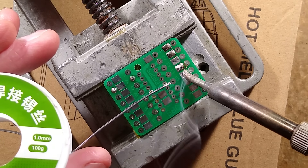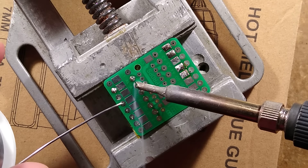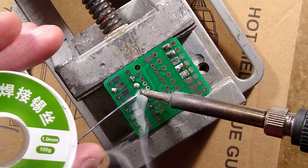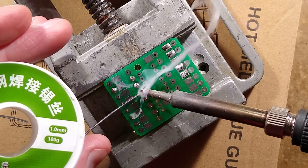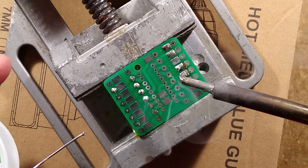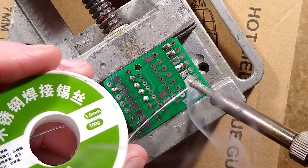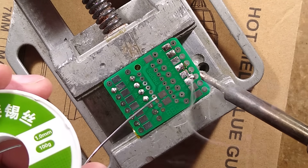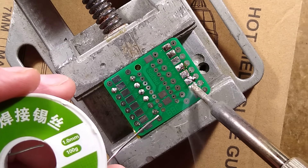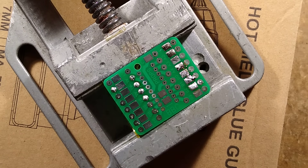Well, it's flowing. The flux does smell just a little bit more aggressive. Let's try the resistors. Is this really 1 millimeter? It just seems a bit bigger. I wonder if this is lead-free solder. It's drying with a crustiness, it's not going down super well. Lots of flux coming off it - there is flux core. It's melting in little pulses. It doesn't look as shiny as the standard lead-based solder - it's got a patina on it. That is very lumpy looking solder. It would work in a pinch but it's not my choice of solder. Maybe it is lead-free, and you know how much I hate lead-free.